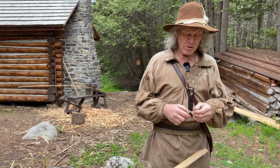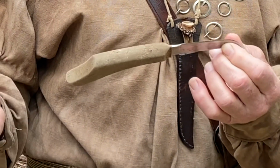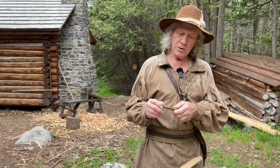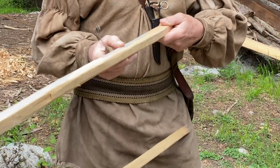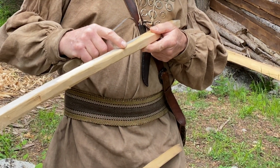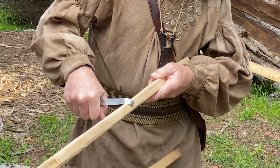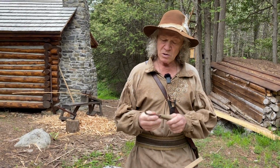Well, essentially what it is, it's a one-handed draw knife, basically, with the added bonus of having this radius at the end, so that it can be used to put radiuses on. For my gunnel caps, I'm going to want a radius where the roots go over instead of a sharp edge. So it works really good for giving me that nice, perfectly round radius on my gunnel pieces.